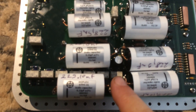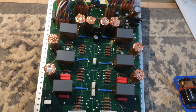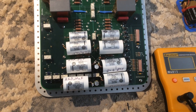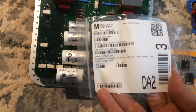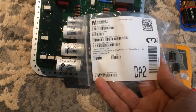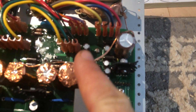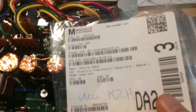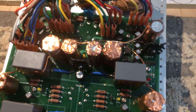I also changed the electrolytic capacitors — I ordered all of them from Mouser. These three capacitors, two in the front and one in the back, were originally rated at 10 volts, 470 microfarads, and were Nichicons. I replaced them with Panasonic 470 microfarad 16-volt rated capacitors — a slightly higher voltage rating. In the back there are also smaller capacitors: 16-volt rated, 220 microfarads, United Chemicon KZH series, replacing Nichicons.